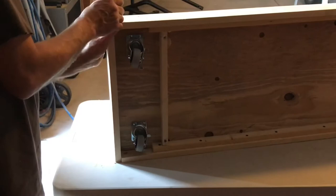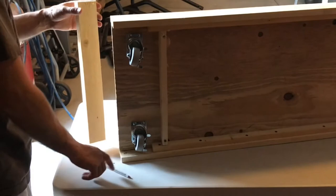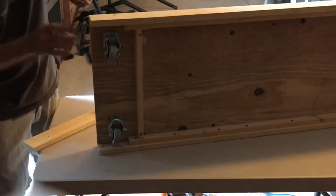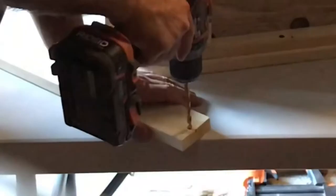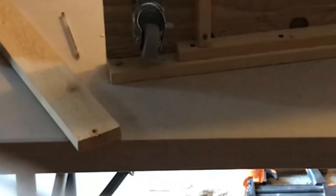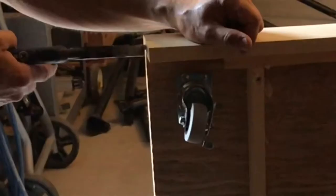To make this side removable where the locking wheels are, I'm going to use wooden dowels on each side. I put my end piece of trim in place and made a mark where I was going to drill the holes — a mark on the end piece of trim and on the side piece of trim. Then using my square I marked the center of each board at three eighths of an inch, which is half of my three quarter inch trim. Next time I have to do dowels I'd just set that trim in place, drill through it with the smallest drill bit, and use that as a pilot hole — my dowels did not quite line up perfectly. Using a quarter inch drill bit I drilled halfway through the end pieces of trim, put the dowel in place, measured how much dowel was left over, then drilled that distance into the side trim.